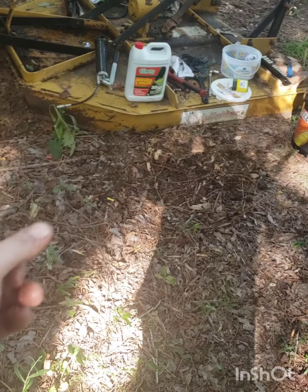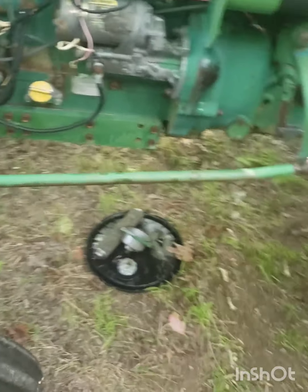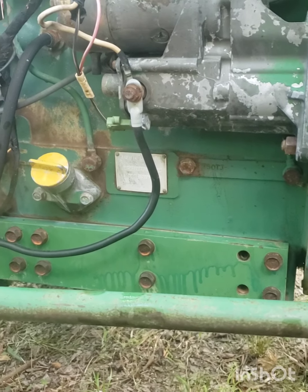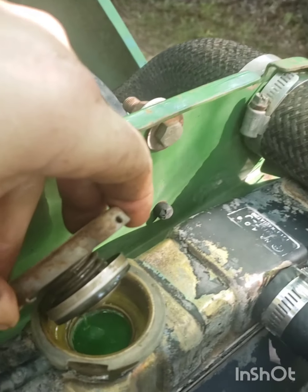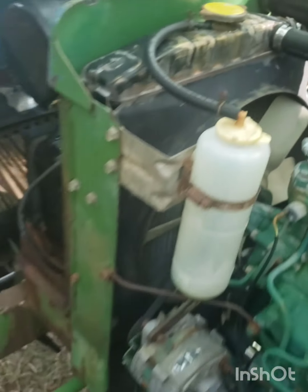Probably ought to put the drive line back on the bush hog. The tail whip's garbage but I'm not worried about it right now — it'll cut. Got a few more things to grease and she may be good. This thing's still dripping — that bucket is about to overflow. Radiator's all clean. Probably ought to check the fluids in it. I brought a gallon of coolant — it looks good in there, a little dirty, probably stand to be changed, but I don't have another empty bucket.